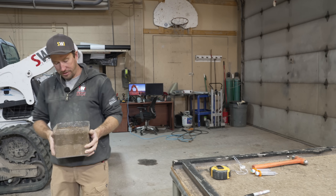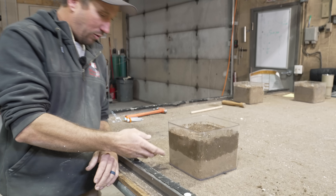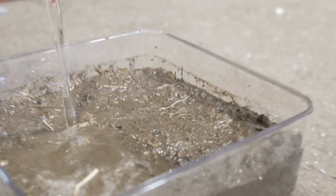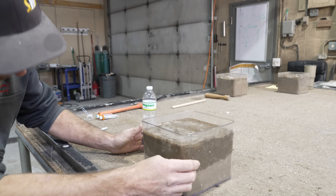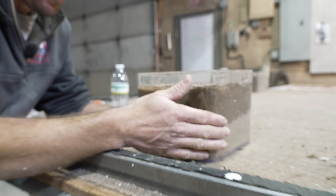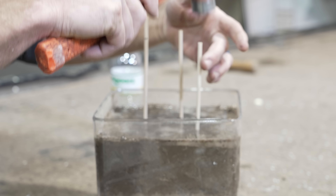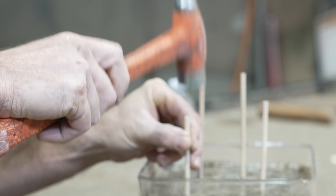So what we did is we took the one foot container, repacked it, and now it's a swamp. You can see that our water level is down here — what's it like with driven posts in a swamp? Our soil is compromised because it's so saturated with water. We're going to drive some posts to two foot, three foot, four foot, and just for fun five feet. We also have really great soil compaction — everything's nice and tight. We're using the heavier posts on this as well.